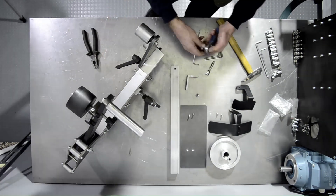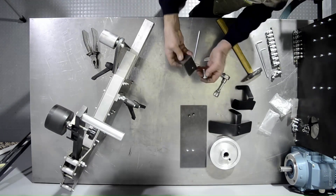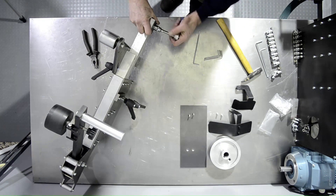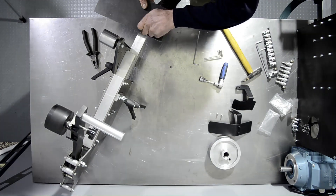If you see the tooling arm is not sliding, loosen it up a bit, get it to slide freely, then tighten it up again. These grinders are all bench tested in the shop for fit and to run smoothly, so there shouldn't be any problem at all.